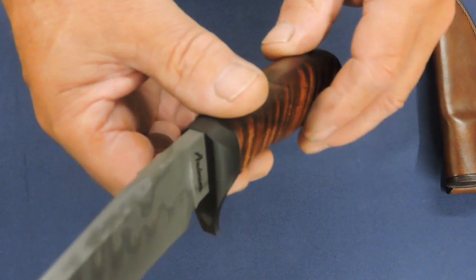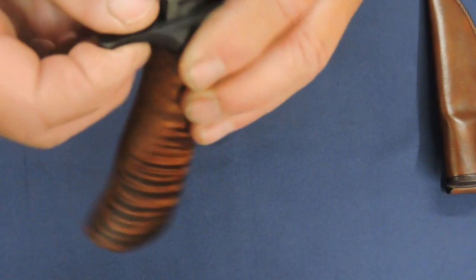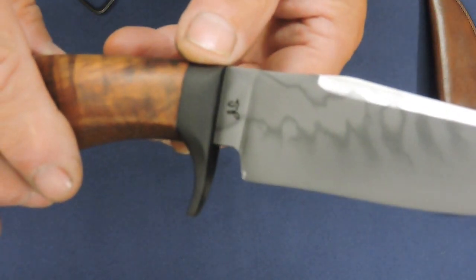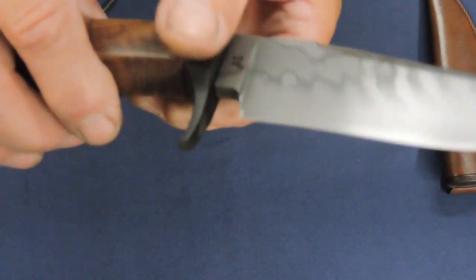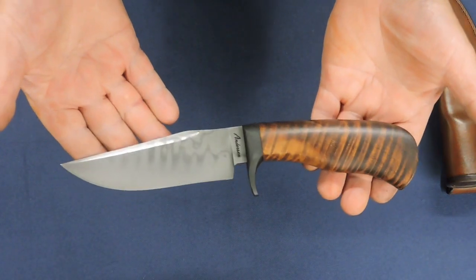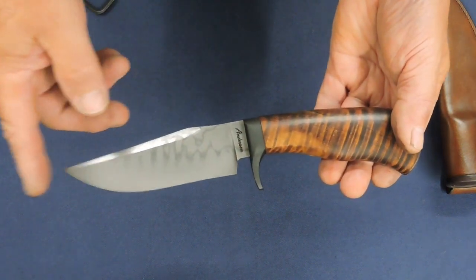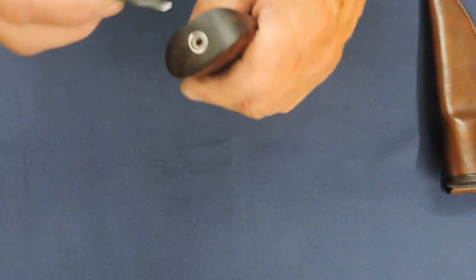The guard here is mild steel — just oil — mild steel that I then blast with some really well-used coal slag. It's real well-used, so it basically has dulled and flattened it, and I call that frosted. So this is a W1 Echo Trail, W1 with Hamon, frosted guard, and we can do a quick takedown on this.